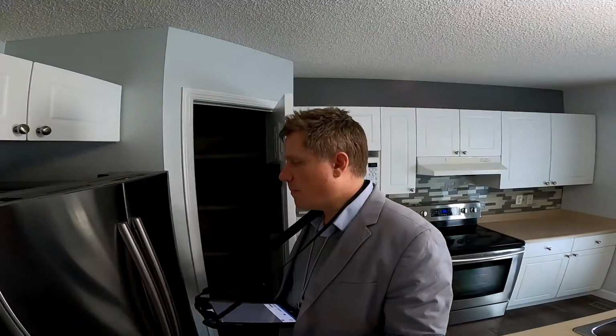That's going to help the iGuide camera get a really good map and really understand how the spaces relate to each other, okay? Now it is mandatory if you have a big closet, like a walk-in closet, or in this case a corner pantry, that you open that up, okay? Your camera is going to have to be able to get the laser in there to have a good look at it.